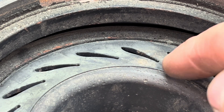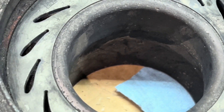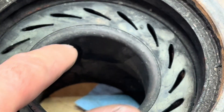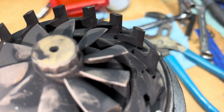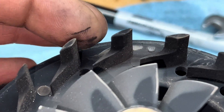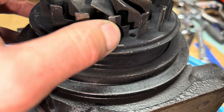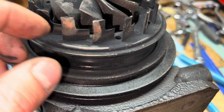Sometimes the ring needs to be replaced too. This one didn't look like it had any serious damage, but you'll know if you try to put a new nozzle in and it's not going. You can clean it up real good by sandblasting it. Here's a good nozzle — see what it's supposed to look like. It's a little dirty, but you can see all the fins are square, there's no damage to them at all, no cracking. Usually the issue is on the backside right here. This one actually has a little bit of wear right there — it needs to be filed.